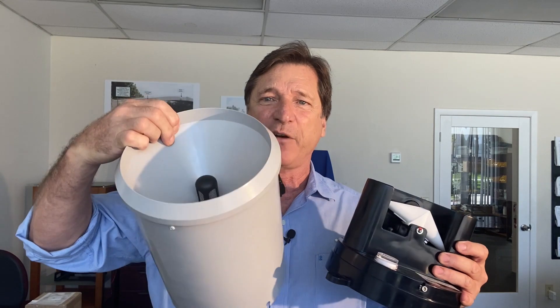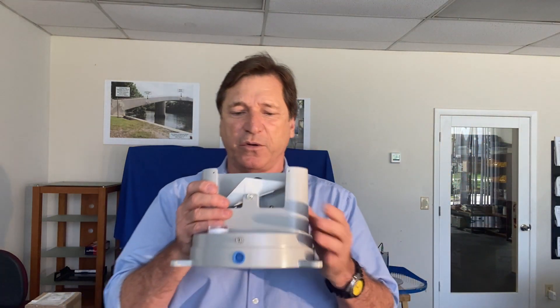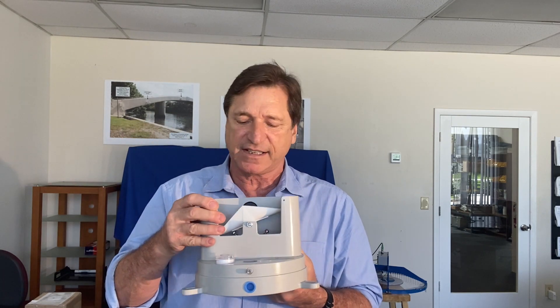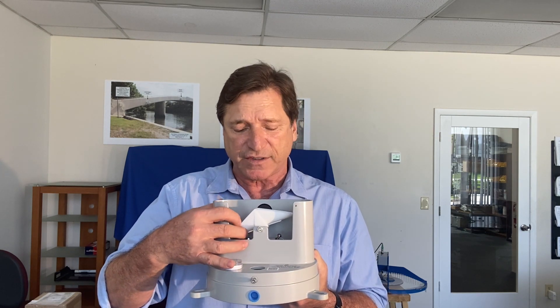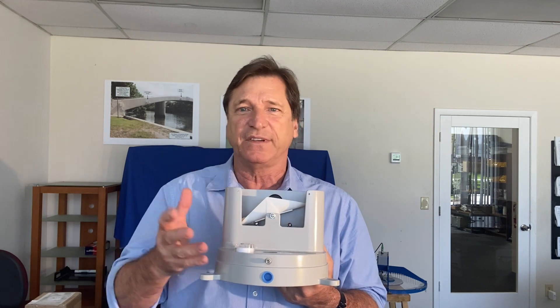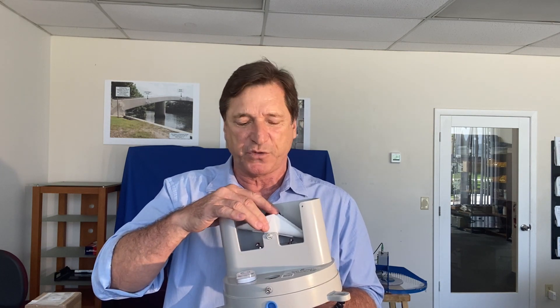The TB4 has exactly the same outer enclosure, finger filter, and siphon assembly as the TB3 — the only difference being the base material. Now I'd like to move on to talk briefly about the bucket material. This is our new bucket — a Teflon impregnated polymer that has been out for about two years. It's an exceptional addition to our gauges because it's a very slippery material. Dust and water drops find it very difficult to adhere to it, so there's less residue in the bucket. This has been a really nice addition.